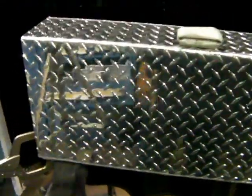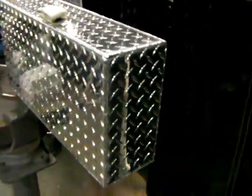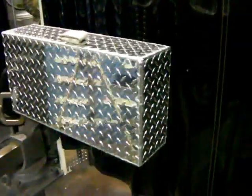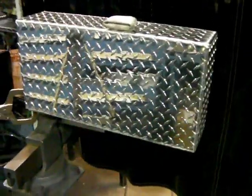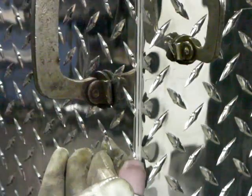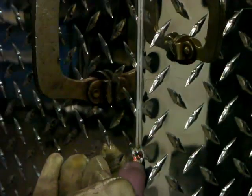What it's going to do is make aluminum weld just a little bit better. It's not a complete necessity, but it'll get you over the hump sometimes, especially when you're welding thicker aluminum. For this project we're using eighth-inch thick aluminum diamond plate, and we don't really need a helium mix, but it still helps.